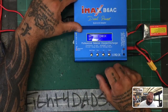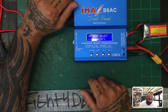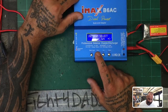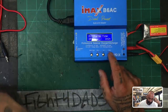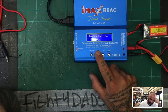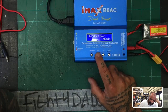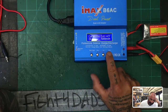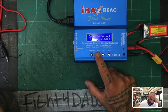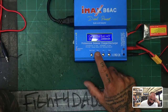I'm at 1800mAh and I'll leave the charging rate at that. I assume you long-hold to start and it checks the battery. This actually runs the same interface as the Thunder Power RC charger. Let's go to User Set and hit enter. I've got pre-charge — I'll leave that off. Safety timer — I don't like that being on that long, so I'm going to crank it down to 60 minutes. Capacity cutoff — I'll crank that down to 2000mAh since I know what I'm using.